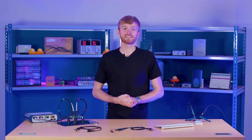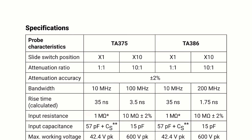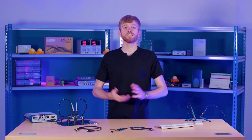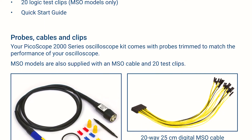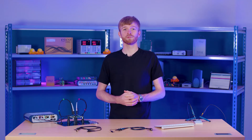Let's go back and look at the probe specifications. One of the key things to look for is the bandwidth of your probe, which simply put is the highest frequency you can see without losing any amplitude. You'll need to make sure the one you get has enough bandwidth for your highest test frequency, although PicoScope probe kits usually come with a probe equal to or in excess of your scope's maximum bandwidth. You'll only need to check when buying probes on their own.